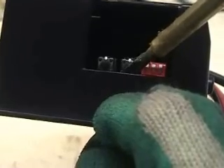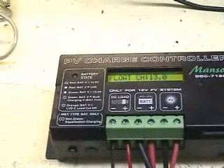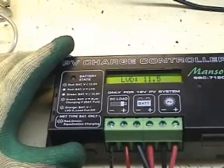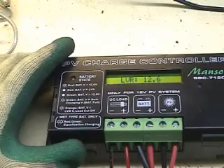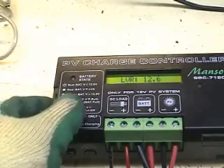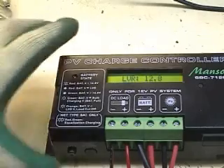To decrease the voltage, press the second tact switch. After pressing it four times you should get 13.0 volts — for this example. For LVR, we will use 12.8 volts for this example, so press the upper tact switch twice, then press reset again.